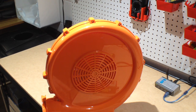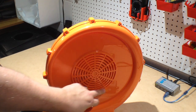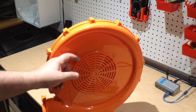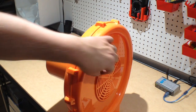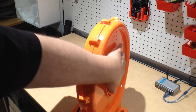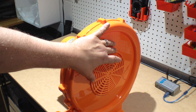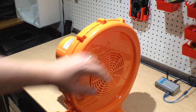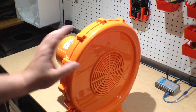I'm going to give this a shot because it seems to work a little bit. I'm going to finish the project in another video and think about how to mount that, because I don't have too much of a lip here. In the eBay picture this stuck out a little bit more, but it really does not stick out that much — maybe a quarter of an inch. I can make an adapter and epoxy it on, though I really wanted a clamp fit. For the exhaust side, I'm going to make a big adapter in TPU so it'll be flexible, and I can get a radiator clamp around it and adapt it down.